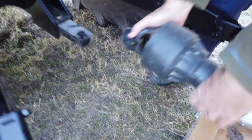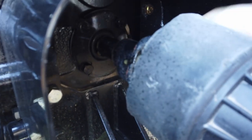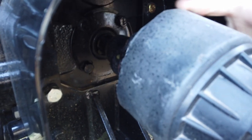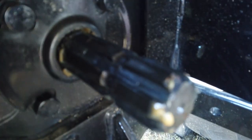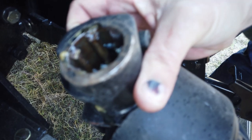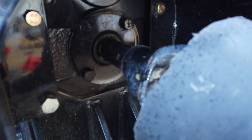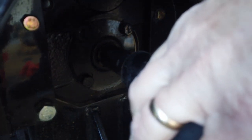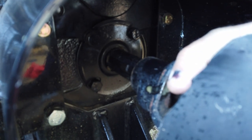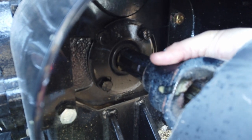Even with a quick hitch system there's really no good way around this. You guys are gonna think we set this up in advance but we didn't — I just got lucky, it was lined up and slid right on there. There's a pin here that retracts in and out, and you'll notice this groove around the circumference of the PTO shaft. When I'm sliding this on I'm pushing that button in to get that pin out of the way and get those splines lined up. With modern tractors with hydrostatic transmissions, a lot of them you can't shift into neutral and turn the PTO shaft by hand, but you can usually just grab the yoke on the end of the drive shaft, get enough torque on it to start those blades moving a little bit, and just get it to rotate slightly until your splines line up. I've got that button to press and I'm working it — pushing and wiggling.